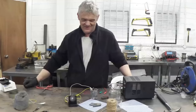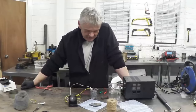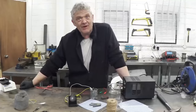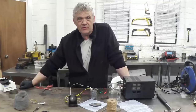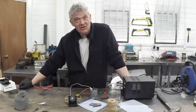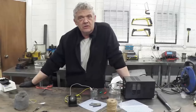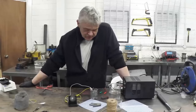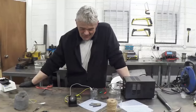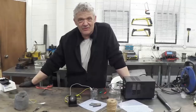Oh wow. That's belting along actually. It's supposed to have about 1.2 volts. Well worth a look at. It's supposed to be a primary battery really. You can recharge it, but if you recharge it you have to replace the zinc. So there we go. An example of a lost battery as it happens. This Lalande battery with the copper oxide depolarizer on an iron plate is not something I've seen outside of those books that I showed you. I can tell that's gonna run for ages.